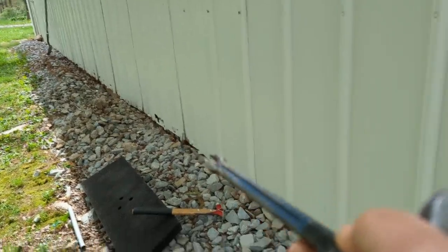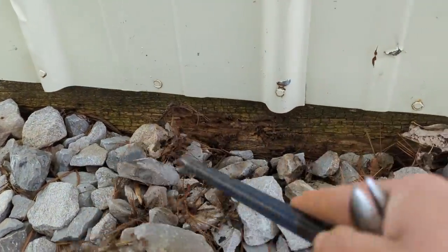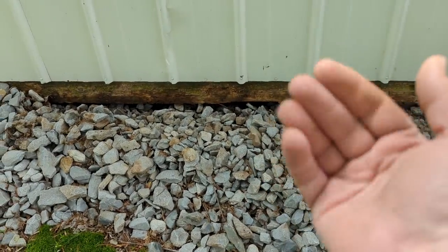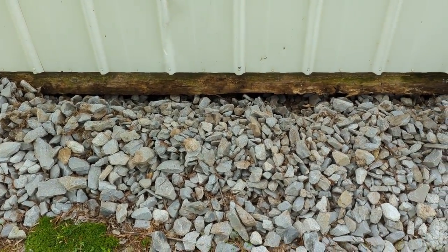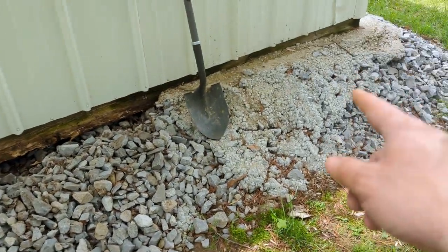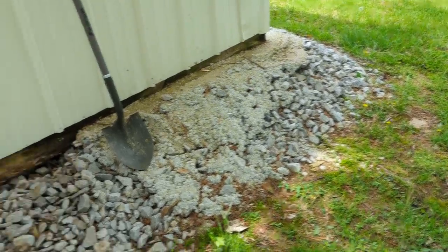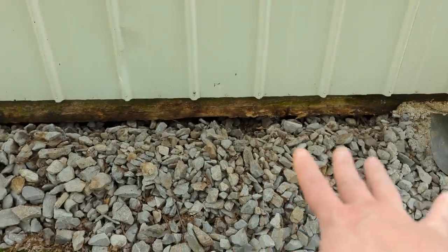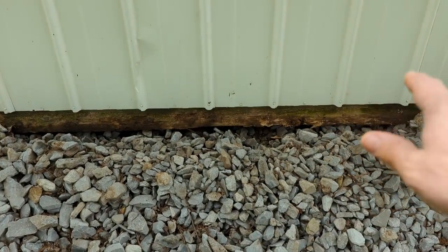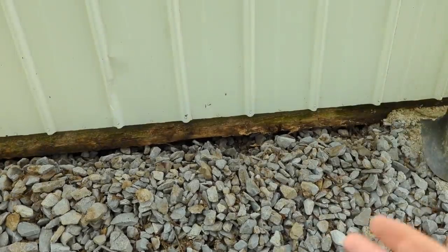So that's where the rust ends, and down here, there's no rust on the siding, but I just peeled this rock back, and this is an ant's nest right here. Pulling the riprap rock away from the ant colony there, we see quite a substantial underhang. And I'm also looking at this concrete that they put on this corner, and I'm looking at the level of the ground, and this tells me that the ground in this area is settling. It's just sort of falling, and the concrete slab in there is cantilevered. It's just hanging out in space with nothing underneath it.